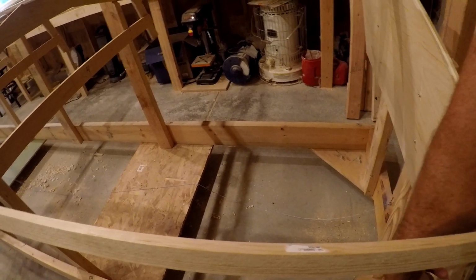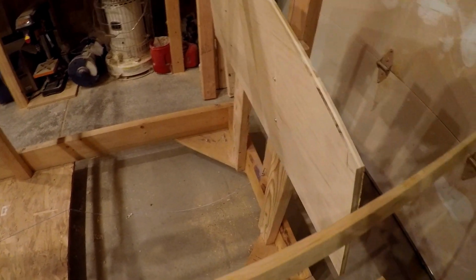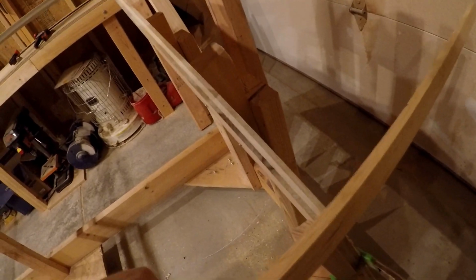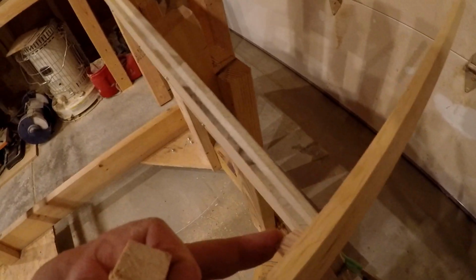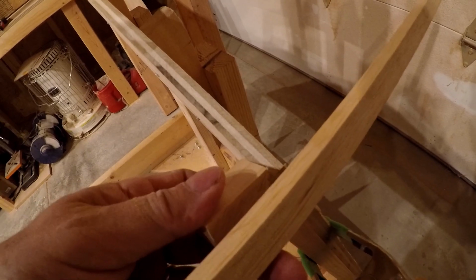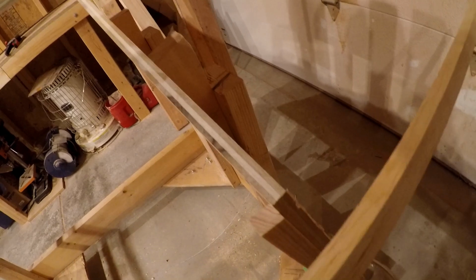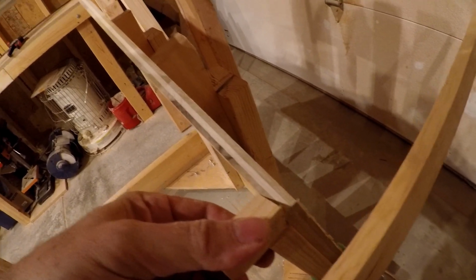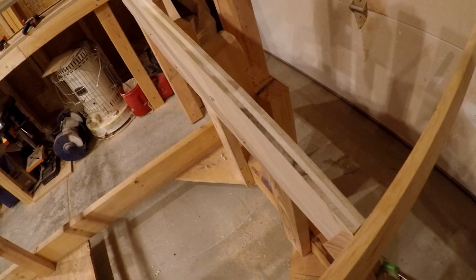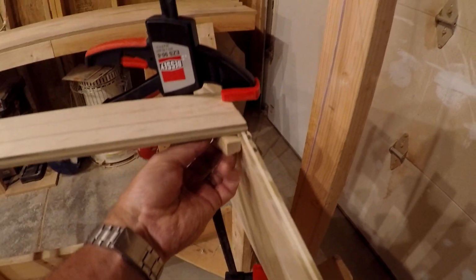I'm going to make 1x1s beforehand, so that's next. A little bit more of how this is going. So we've got our chine coming along, giving this angle. We know the actual piece is going to be sitting in like this. So we're going to make something that helps us to hold that on there, and also when it's beveled provides additional gluing surface for the plywood there. We'll go on there.